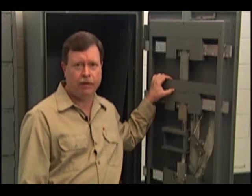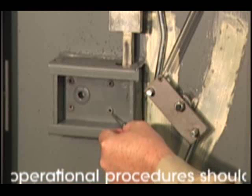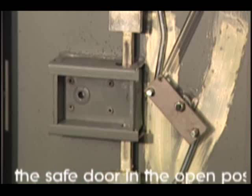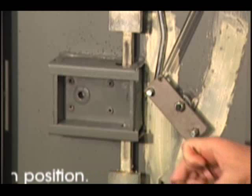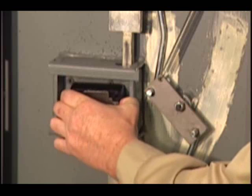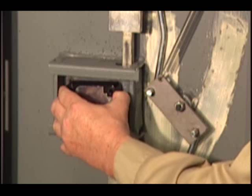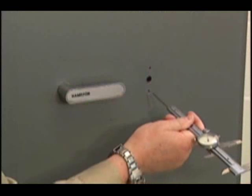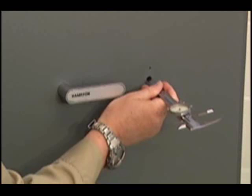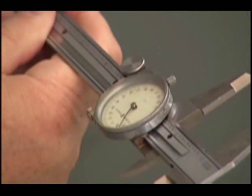To begin, we'll take a look at the lock mounting surface. Note that on this mounting plate, the mounting screw locations are actually raised studs. We're going to measure the door thickness, and to give us a good location for our measuring tool — a pair of dial calipers — we'll take the 2740 lock body and place the cover side down against the mounting studs. From the other side, we'll insert the depth gauge portion of our dial calipers. With the cover side of the lock body acting as a stop, I insert the depth probe through the spindle hole, bring the caliper base up against the dial ring mounting surface, and I get a measurement of 1.080 inches.